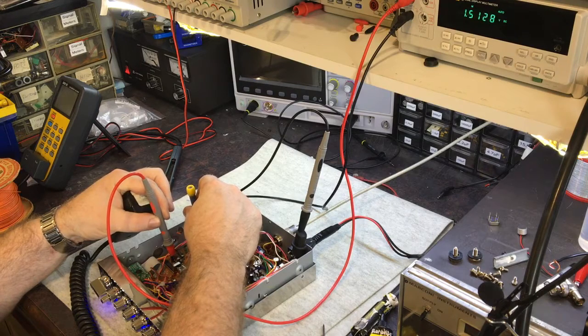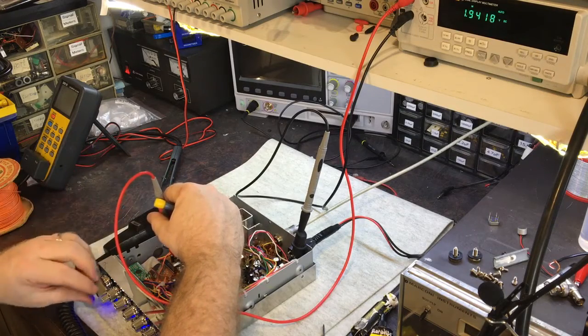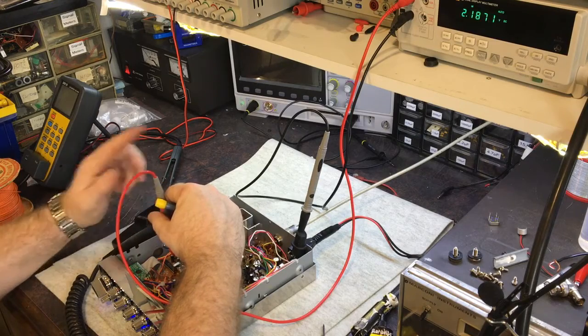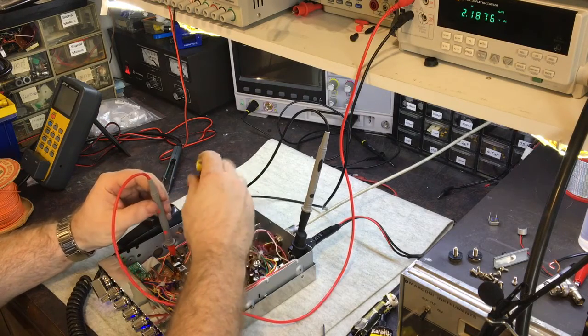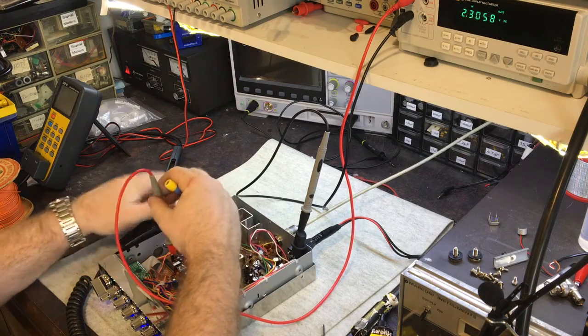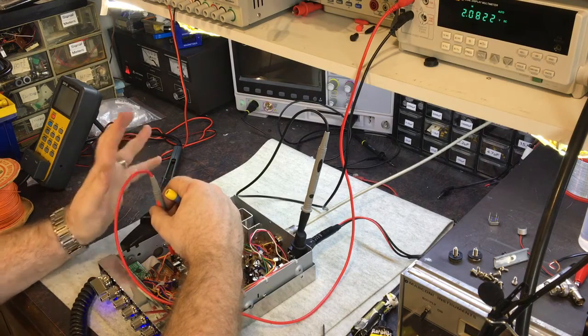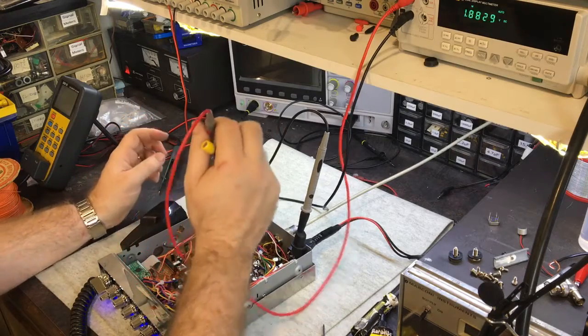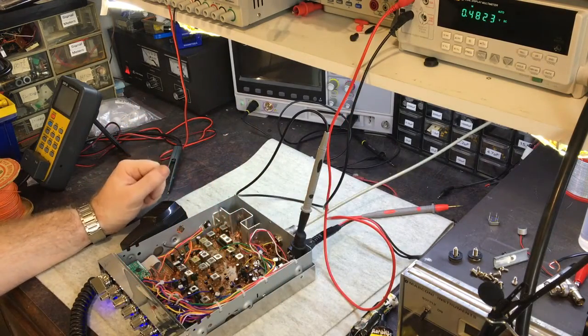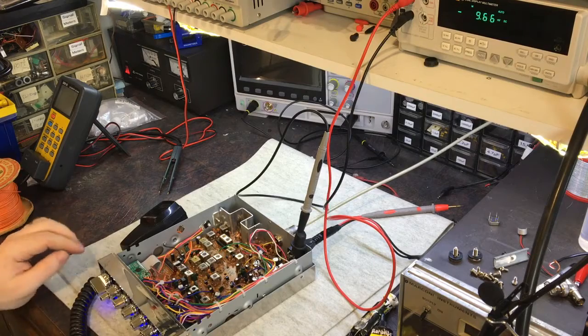You always have to give things a bit of a window, so when you get a variance with temperature and that sort of thing, it still works okay. So that's 1.5 volts right now. Yeah, 2.1 there is fine. So I can probably go a little bit further actually. There you go. Let's go 2.3. I think there it starts to get a bit faster. So 2.3 volts there on RX, which gives us 1.8 volts on TX, which is a nice window, both ends of the scale on transmit and receive. And that means that it won't stop working when it gets cold or hot, because it's got enough of a window at each end of the scale on each channel on either transmit or receive in order to keep working.